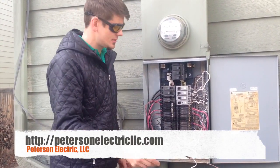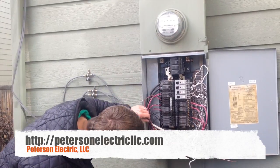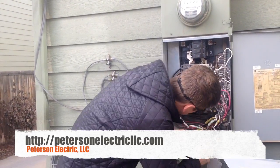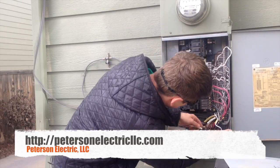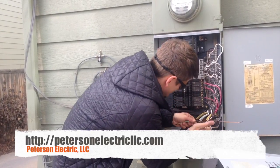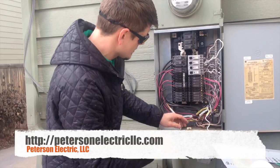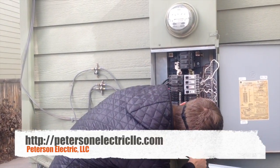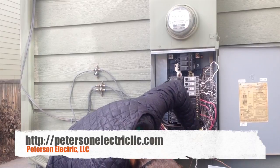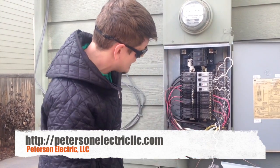We're getting paid to test, not change parts. Boom — still blowing. Let's isolate now and see if this ground on the master bedroom retreat matches right here. So we know this was labeled right — that was really nice of the electrician. Make sure your house is labeled well to your panel. When you get into problems like this, it can actually be a lot easier for someone to trace if they know where things are going. That was the other ground next to it. We want to make sure this ground is not touching another ground, like it is right there on a yellow circuit, which is probably the dining. We want to make sure none of these grounds are touching because that will just travel the path too.